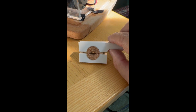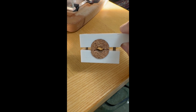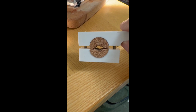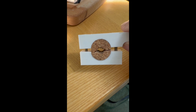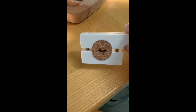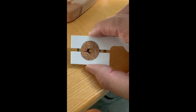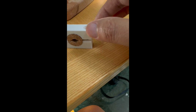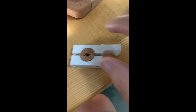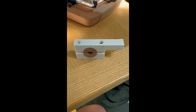What you do is squeeze the shaft with the cork material. Because I'm in Italy where the vino's all over the place, cork is also very good for this kind of application. Had I used another 3D printed plastic, these things would just weld together and melt. So cork was a very good brake material. These upper and lower parts are held together with screws, and when you tighten the screws, you apply more brake force to the shaft. The point here is what presses on the load cell, so from that you can figure out the torque coming from the shaft.